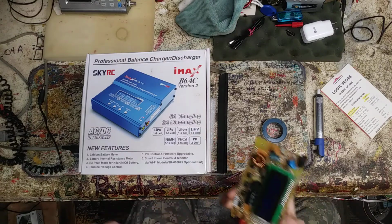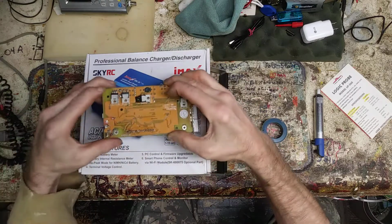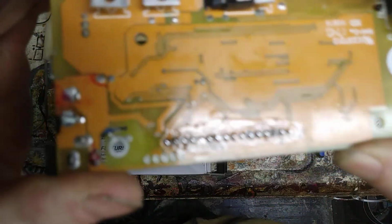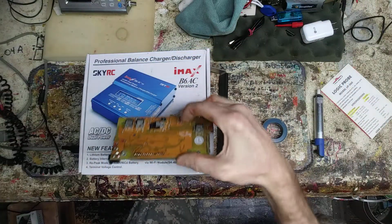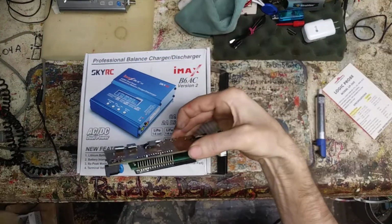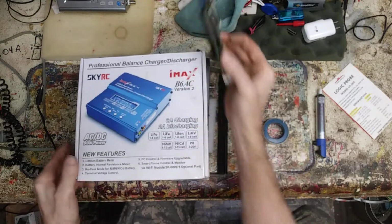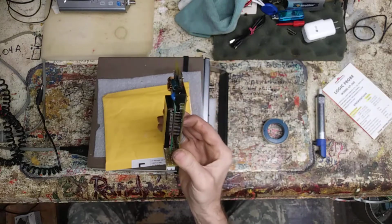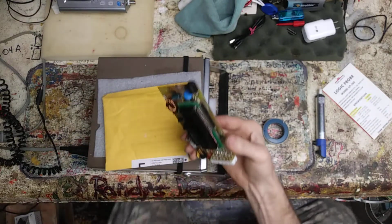So the last thing I gotta do is pull the board, and I just tried solder sucking it. You can see the darn solder sucker, I don't know what the deal is, but it just has a real hard time with tiny pins sucking them all the way out. Knowing they're through hole, I mean, come on. You still should be able to suck that all the way out. But anyways, that's what this board is part of, because one of the pieces under here is a part that I've got to get to, to test.